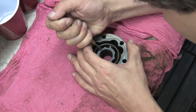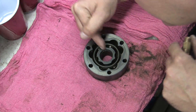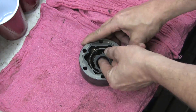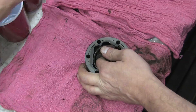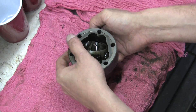Make marks on the retainer and also the inner race, because they go back in exactly the same order as well. Once you're all prepped, pull and turn the inner race upright to release the bearings and rotate it into position to remove each one individually. Be careful not to lose track of the order of the bearings.